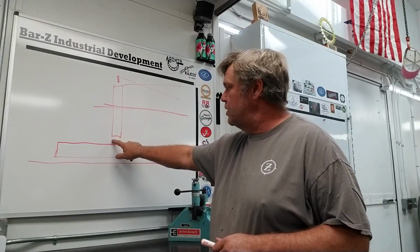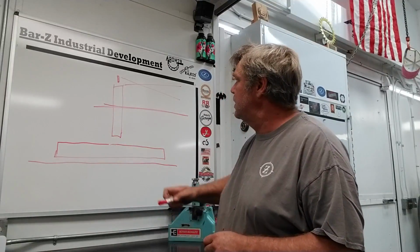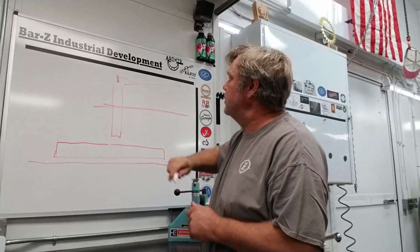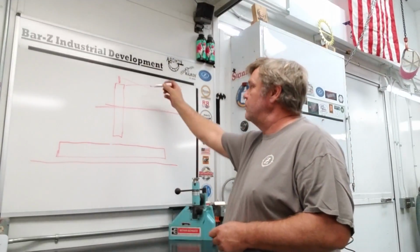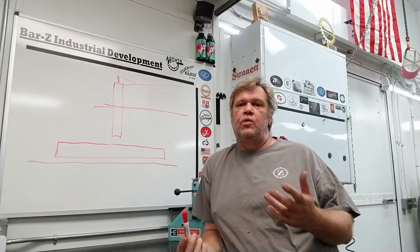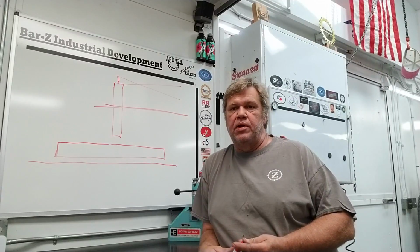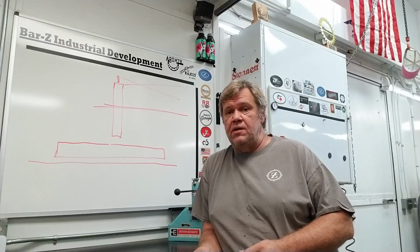Well, you know what? We're not putting a diamond down on the plate anymore. Now we're putting it above. We've got this little fella up here on top, and we're dressing across this way up on top of it. Now what's so good about that? Why do we want to do an overhead dress as opposed to just sticking it on the plate that we know is accurate and know is parallel with the axis of the machine?